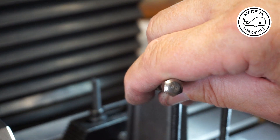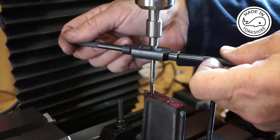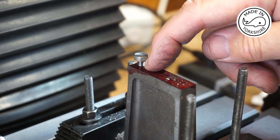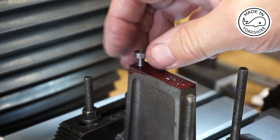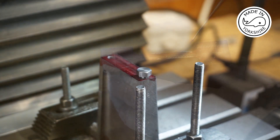The good thing is we haven't come out of the sides here. I don't believe it — I've not tapped enough threads; there's about a four millimeter gap and it needs to be way below that. I'm going to have to drill again and tap some more threads — I reckon I need to go down another 78 thou, so in total that would have been about 0.4 of an inch. I'll do all that off camera, then drill and tap the second one. That's worked out okay — very happy with that.